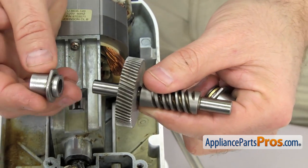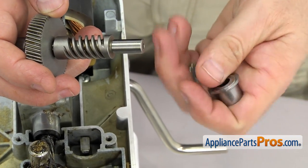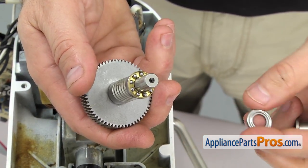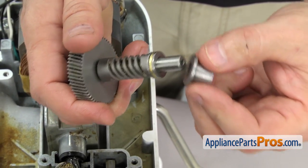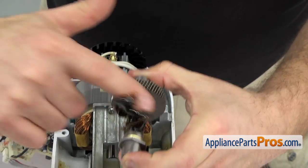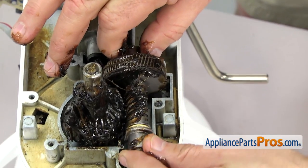To put the new worm gear together, we're going to put the rear sleeve bearing on. This is the one that has the extra flange on it — it goes in between the gear and the bearing. Then we can put the thrust bearing on. It's three pieces. You want to make sure that the grooves go towards the center, so put one washer on with the grooves facing in, put the ball bearings down, and then the final washer against the ball bearings. Then you can put the front sleeve bearing on — this is the one that has no flange, so it sits right up against the thrust bearing. Once you have everything together, we can put some grease on it before we put it in. Once you have it greased up, we can set it into the gear case. You want to make sure that the flats on the front and rear sleeve bearing are vertical, then you can set it down into the housing.